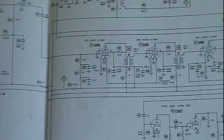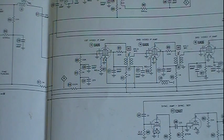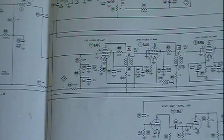You've got to remember that a television signal is extremely wide band. It's actually just under 6 megahertz wide, or roughly 6 megahertz wide. That's where it starts coming up on the slopes. The reason for that is, unlike radio, in radio you just have audio. Audio doesn't take up a lot of room, just a few kilohertz either side of center frequency, and that's it. There's not a lot of information. It's easy with audio. Think of it this way.